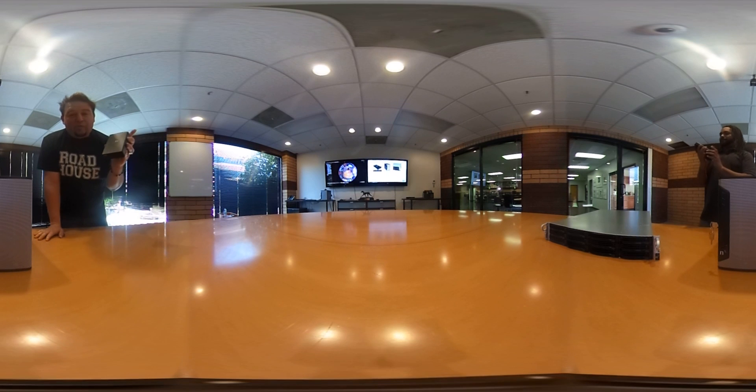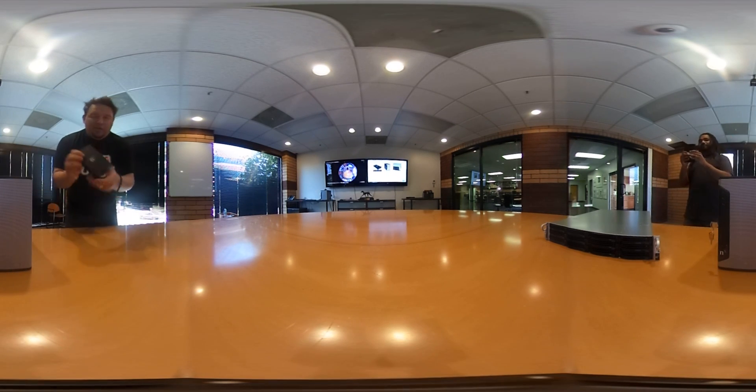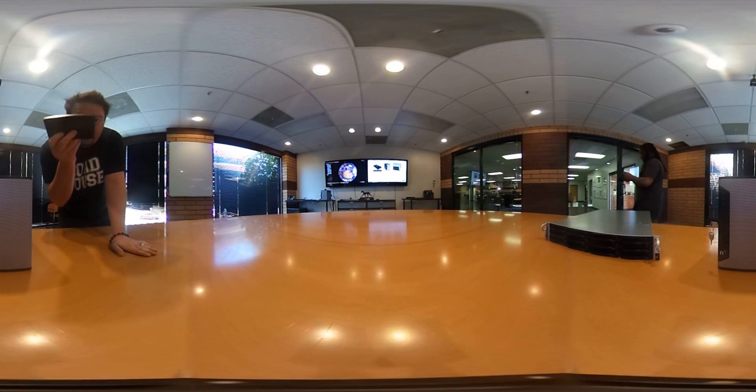So the NX1 is our smallest device. We only have three devices just to be clear: NX1, NX2, NX3. The NX1 is our smallest form factor device. It's an ARM-based device, an ARM A20 processor. It has a gigabyte of RAM in it and it's designed to handle four live HD video streams and run at less than 30% CPU.